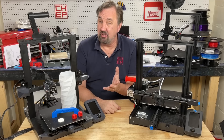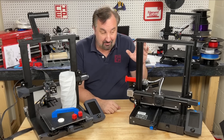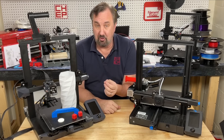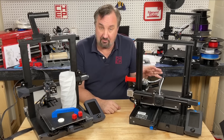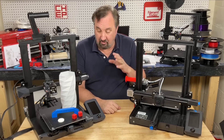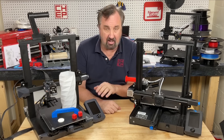You're not using all the memory anyway, but still for $429 I should get the bigger chip. If this is due to the semiconductor shortage — and I've heard it might be — they're probably going to start putting that 256k chip into other machines. If that happens, we have to watch what firmware we download, because if a firmware built for 512k gets loaded onto a 256k board it may not load, or it may load and not work right. I hope Creality doesn't do that, but this one for $429 should have had 512k out of the box.